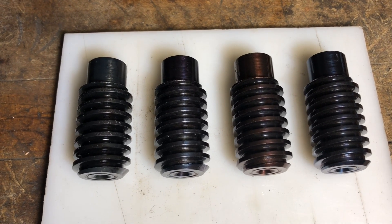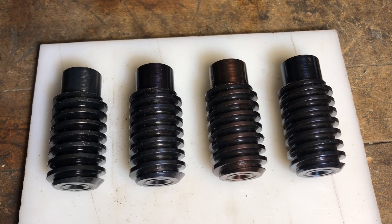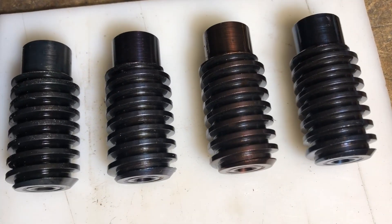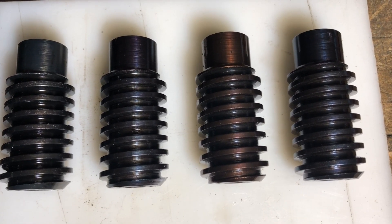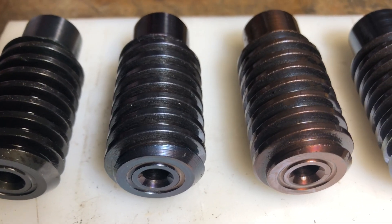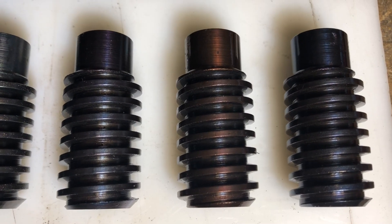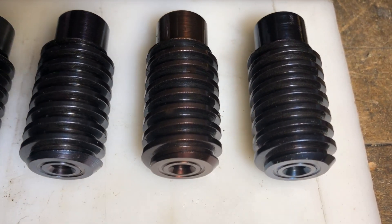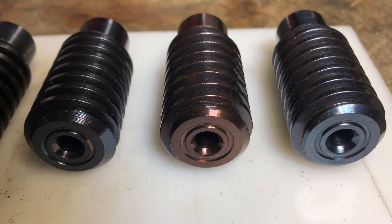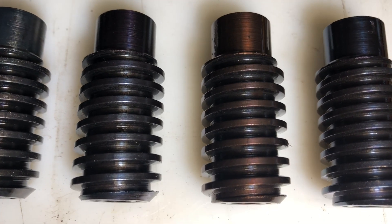Here we have all the parts that we did today. On the left is the one done with the torch, taken as far in the color spectrum as it would go — finished out as almost like a charcoal type color, very consistent all the way across. The second one is the one we tried to stop at blue, also done with the torch. This one has a little bit more color variation, going between gray and blue, probably because the torch is not heating the part as consistently. The third one is the part done in the oven, stopped at purple. By putting it in the oil, it seems to have gone back a step to that dark bronze color — very consistent finish across the entire part.